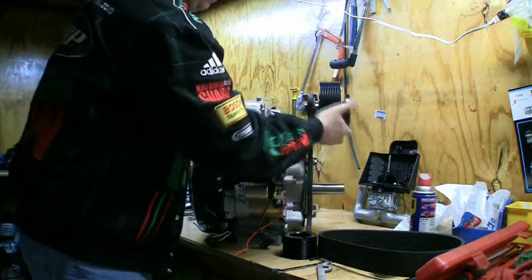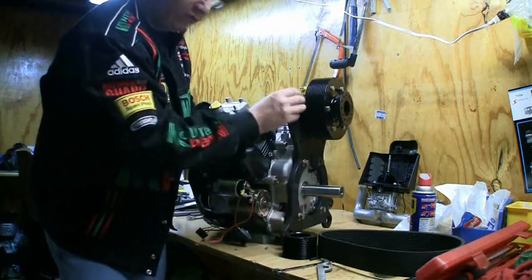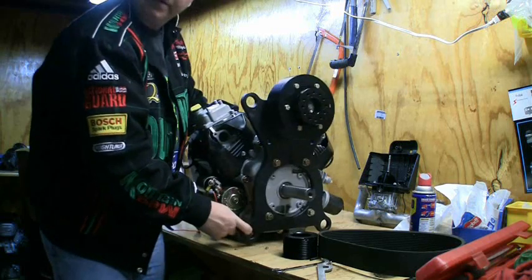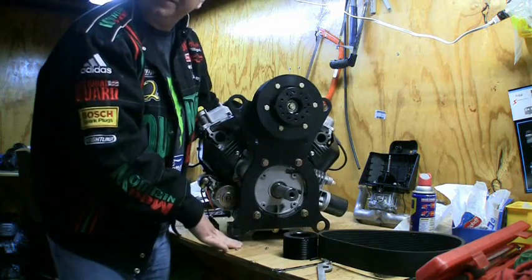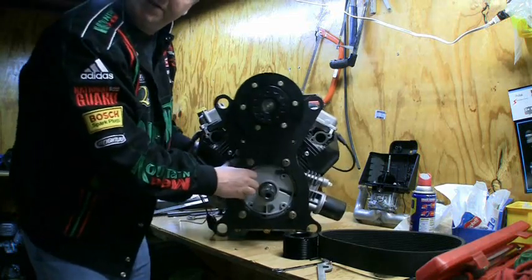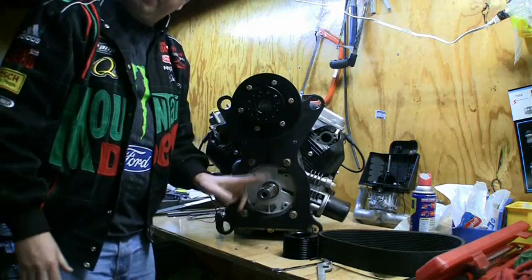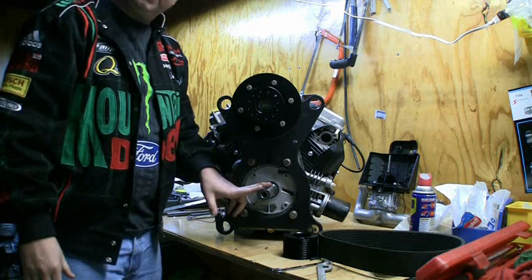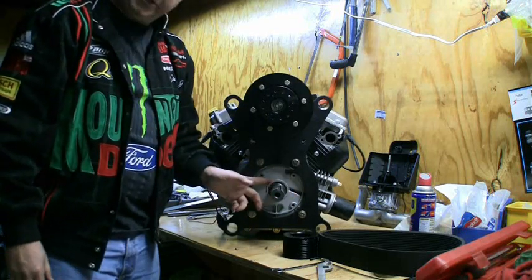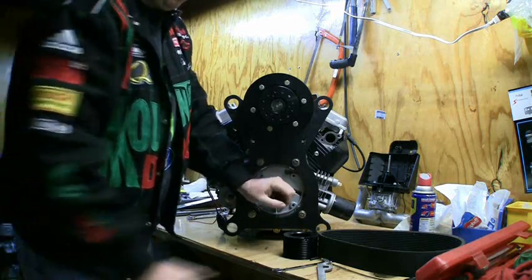Now we've got the top of the drive — made sure everything is good. We're going to move the engine around. This drive plate is a half-inch thick aluminum plate. The extra holes and slots are for some of our other engines that we use this drive for. This engine is a straight shaft, which is what we prefer because most straight shaft engines have larger crankshafts, larger bearings — they're industrial.